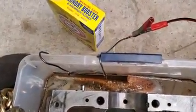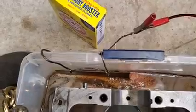It plates out as iron three oxide — effectively converting it. The tank is just filled with water and a lot of sodium carbonate — basically a salt solution — to get a little electrolysis going.